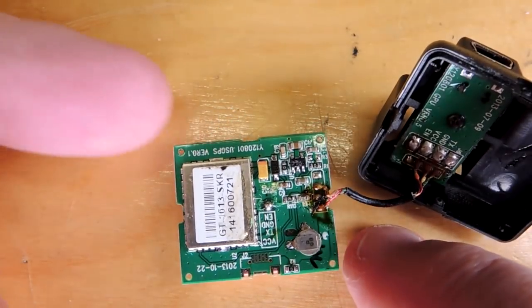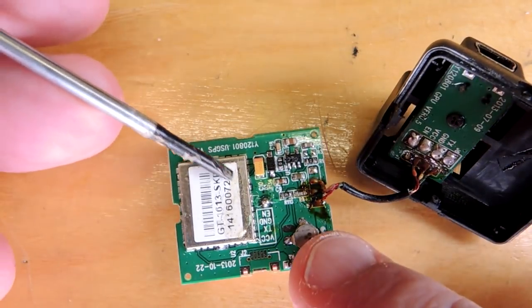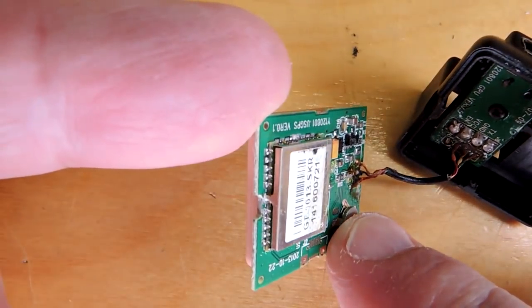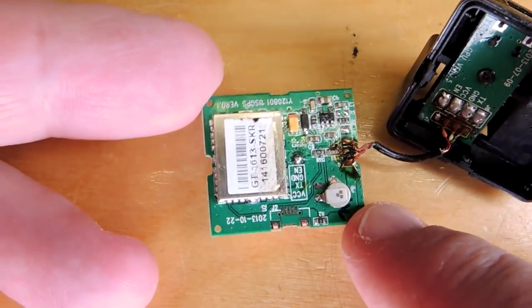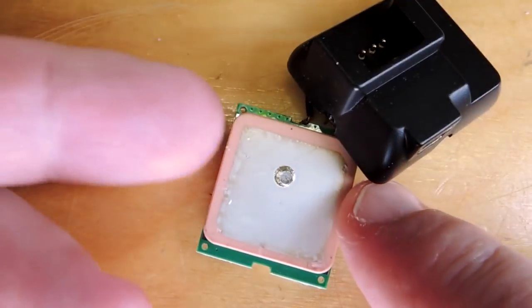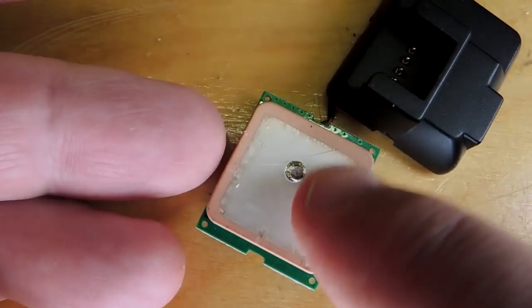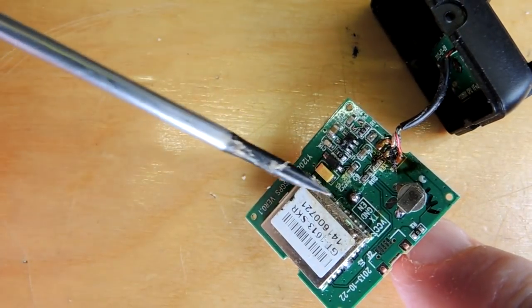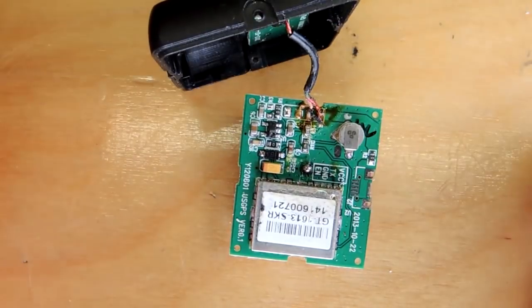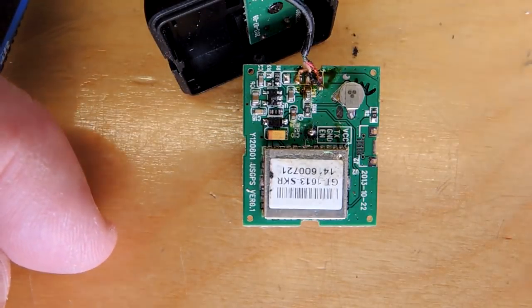The module here is a shield for the RF. We'll take that off because that's actually where the interesting integrated circuit will live. And on this side here it looks like an antenna for the GPS signal — some sort of metal can. There's some sort of solder blob on this side which seems to carry through to this side here, so that'll be interesting. Let's get the hot air gun out and take this thing apart further.